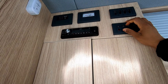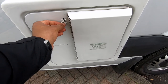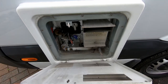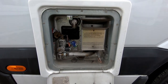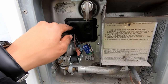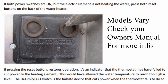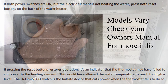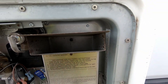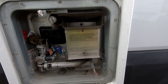If you want to access this panel, make sure after just using it — it'll be hot, so be careful not to burn yourself. Over here is your main system. You've got some resets over here — you can push these to reset the whole water heater. Sometimes you get a lot of cobwebs and dirt over here, so you can open this panel up and give the area a good clean.